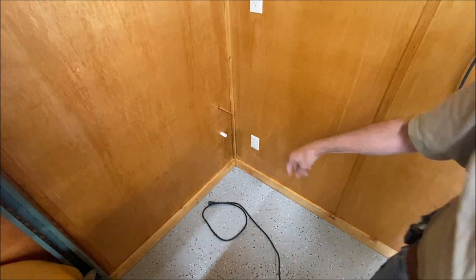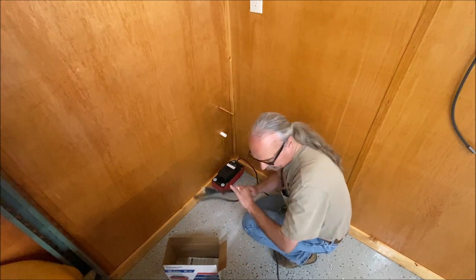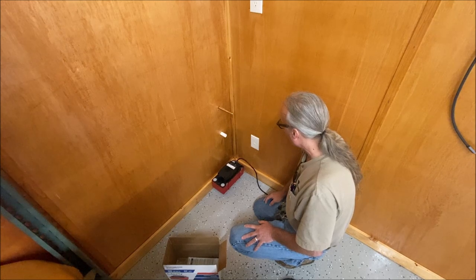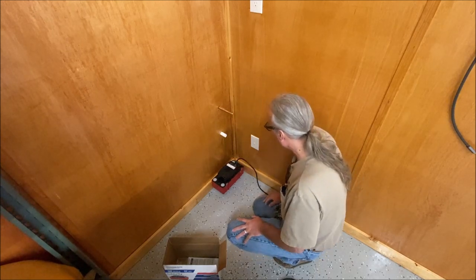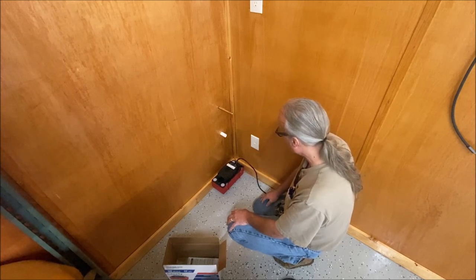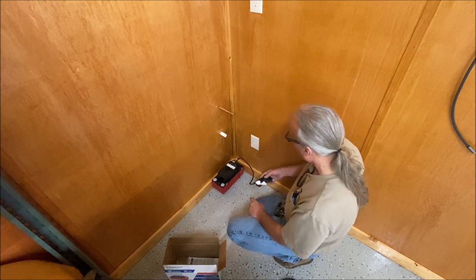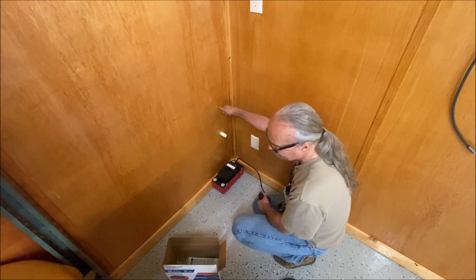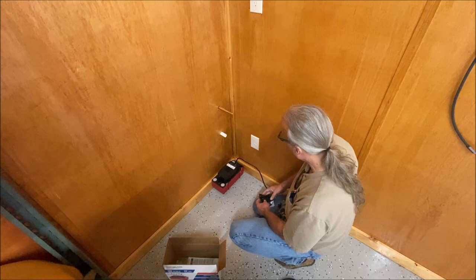and figured out is what I'm going to do for a safety here. And what I mean by a safety here is what it's going to tell this machine not to make any more ice if the pump fails. So I had thought about putting a pan here and putting this inside the pan and putting a float switch in it, and, you know, also wiring it through this safety and shutting off the water or shutting off the power.